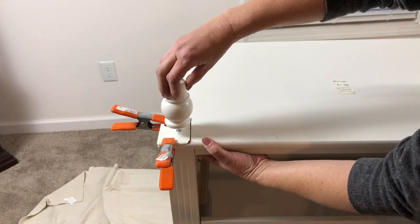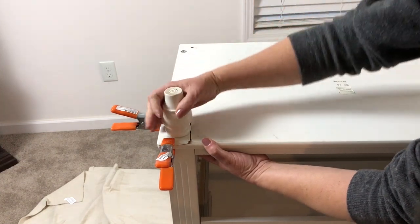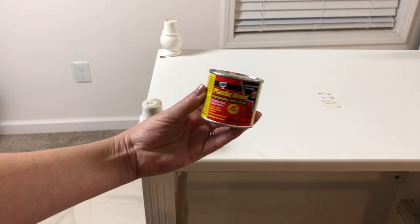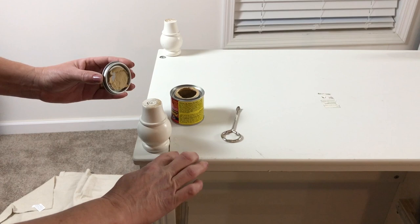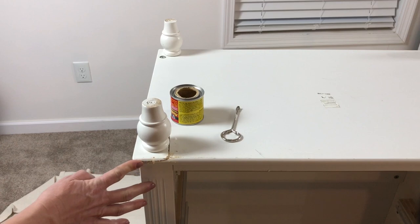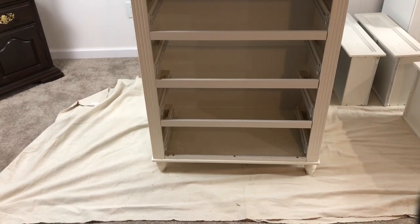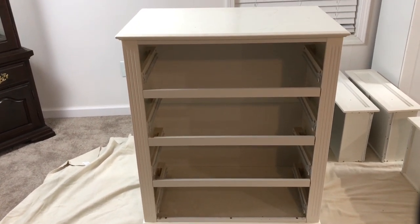While that glue is still setting I'm going to go ahead and reattach that foot to make sure it's going to stay in place and also provide some added pressure right there where I placed the glue, and I'll go ahead and add the remaining feet as well. Once the glue's set I'll remove the clamps and I am using some plastic wood filler to fill in that crack in the front and on the left hand side. After that dries I'll take some sandpaper and sand it down nice and smooth and if I need to I can touch it up with a little bit of paint.